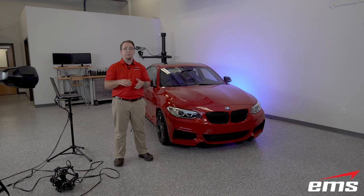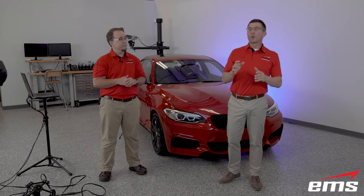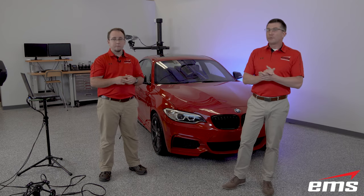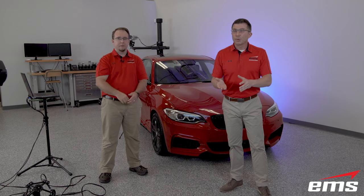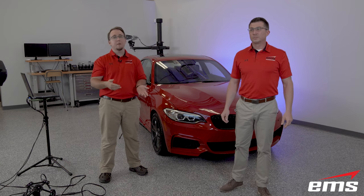The target capture can be conducted with the standard tripod that comes with the Metroscan or the shop floor stand. Speed was one big area of improvement Creaform made on the new Metroscan. The second area was increasing accuracy and resolution. The new Metroscan Black Elite's accuracy is on par with last year's HandyScan Black Elite handheld scanner at 0.9 thou or 25 microns, based on VDI/VDE 2634 Part 3 standard within an ISO 17025 accredited laboratory.